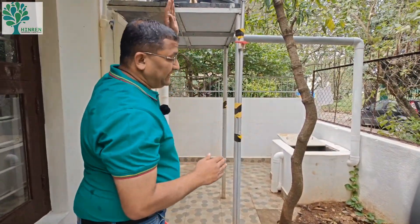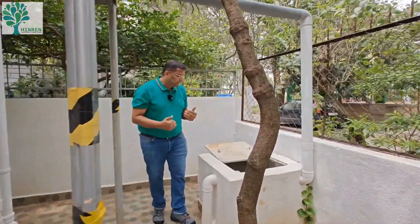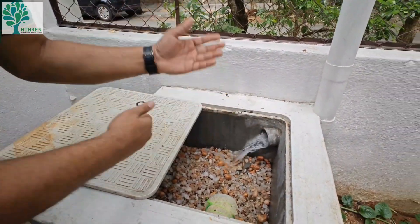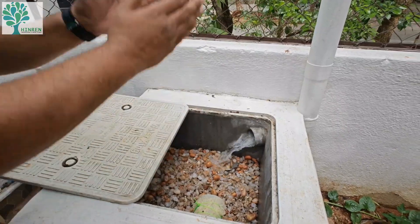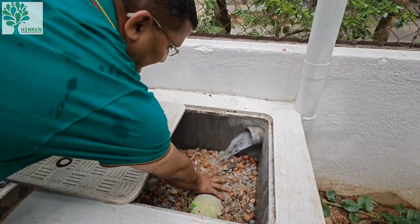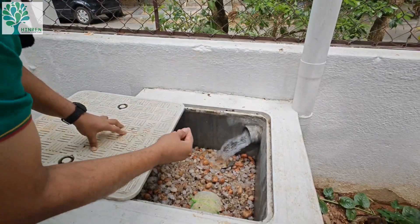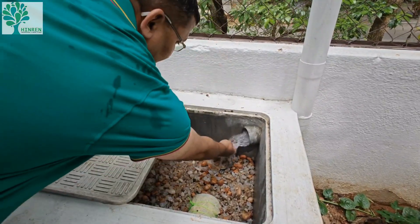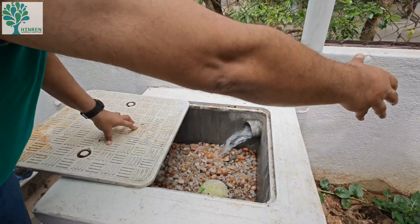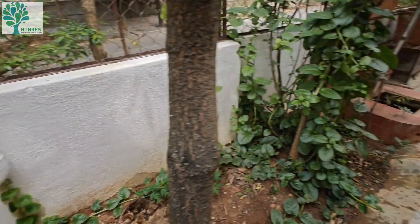The overflow from the sedimentation tank goes into our filtration tank. This is the same mechanism for rainwater — both the rainwater and the solar panel cleaning water go through the same system: sedimentation tank, then filtration tank. In the filtration tank I have gravel on top, below that a layer of activated carbon (IV-600), and below the activated carbon we have aggregates, so these materials do not drain into the sump. The water, after filtering through all these layers, goes to our storage.